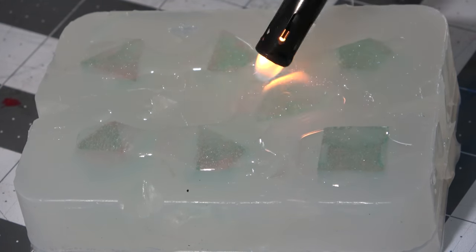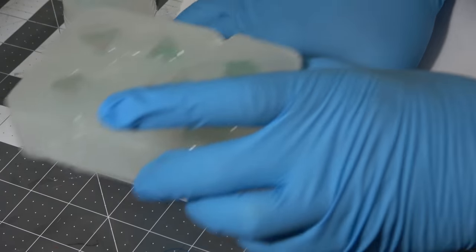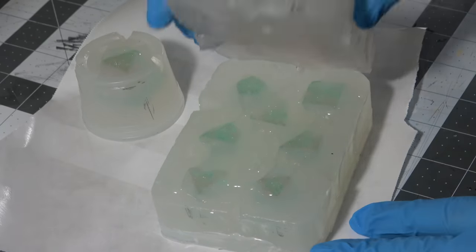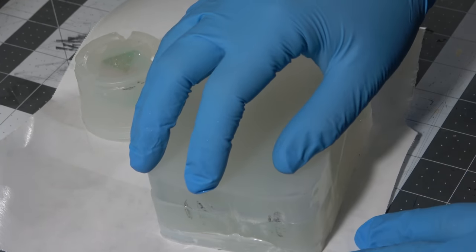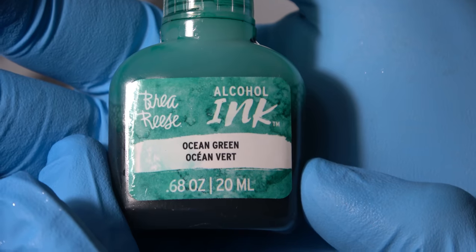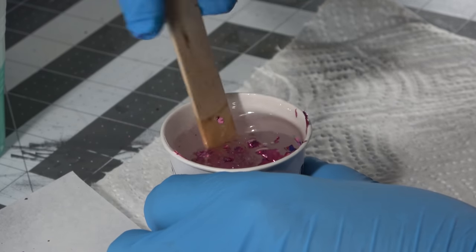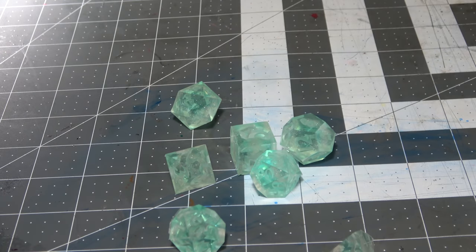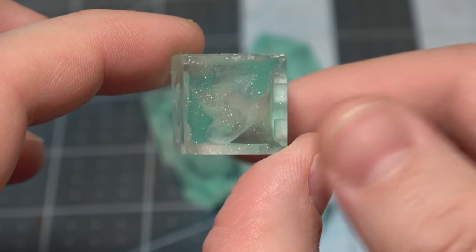After we're done with that, you're going to see a lot of bubbles float up to the surface. Normally a pressure pot will get those, but with a cap mold we want to be extra sure. If there's surface bubbles, you can pop those with a quick pass with a lighter or a torch — make sure it's very quick or else it could burn your silicone. I always like to put a little bit of resin on the actual caps or over the low numbers so there's always that extra bit of resin. Then I always put this on a bit of wax or freezer paper, because when you put the cap on, there is going to be resin that overflows over the sides. Just wiggle it into place — don't push down or you're going to leave a gap in the bubbles. For the big sprue-cap combo, I do the exact same recipe, making a pink foil and green mica powder dye. After 36 hours — normally you only wait 12, but 36 hours is for a super full cure to where these are rock hard and you can sand them — we have some completed dice.